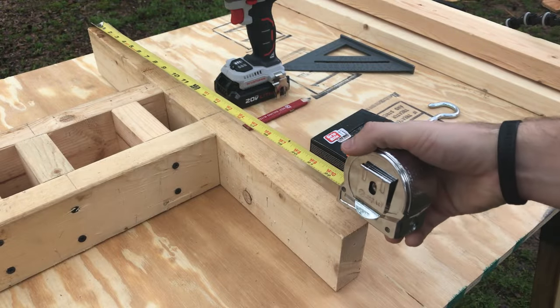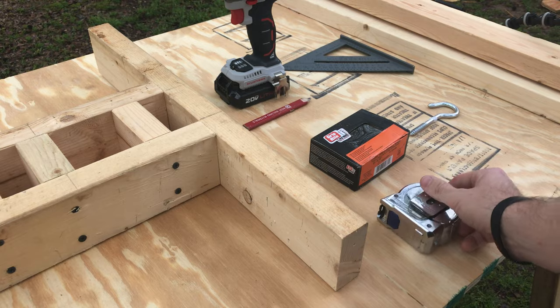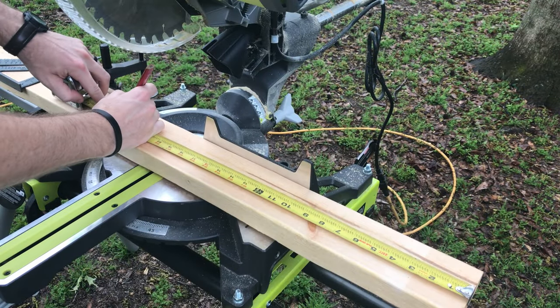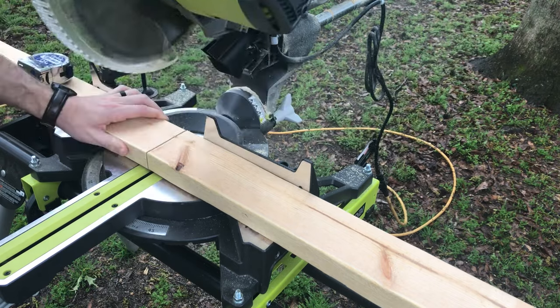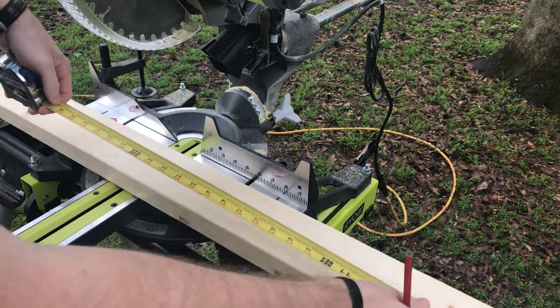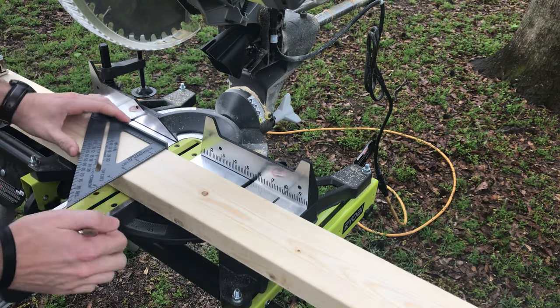The feet of the target stand are 24 inches a piece. Cut one out of one board and the other out of the other board. The total measurement for the pieces of the base is 8 feet, so you might think you could cut all the pieces out of one board. But when you take into consideration the thickness of the blade over that many cuts, you're going to come up a little bit short and your last piece isn't going to fit. So cut half the pieces out of one board and the other half out of the other board.